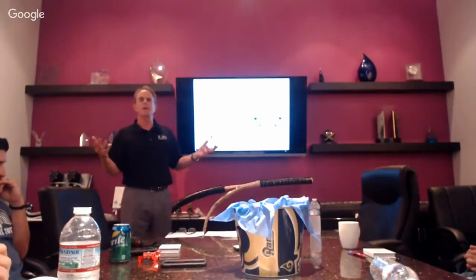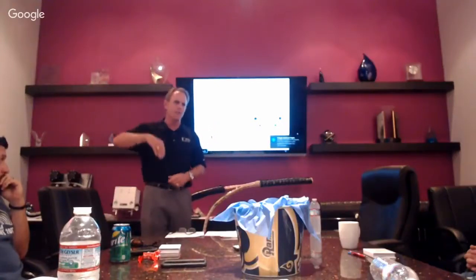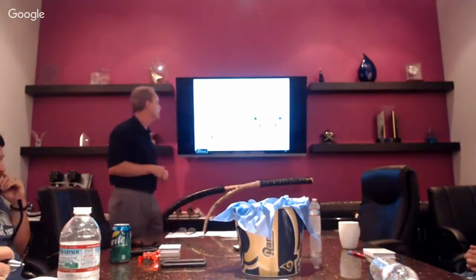We do have another one that's downhill, so the walk-in set. Again, it's not a big deal. We just have to take care of the negative lift. And oddly enough, sometimes when you have negative lift, it requires more pressure. So if you have something falling downhill and going to turn and come up into a tower, you have to pack it. Otherwise, the beer tumbles and it kind of separates. CO2 comes out. All kinds of little weird things.